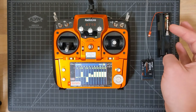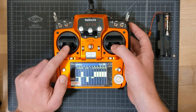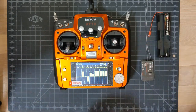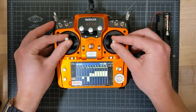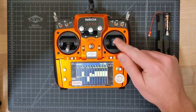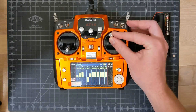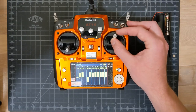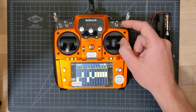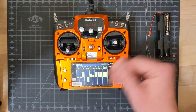Driving by controlling one motor with each hand is pretty hard to control precisely. Construction equipment like Bobcats drives like that — you control one track speed with each arm using a lever. But for this toy it'd be a little too twitchy. So I wanted to map the CatToy to just one stick: pushing forward drives it straight, turning the stick left or right makes it turn, and if it's sitting still, pushing left should make it spin left and right should spin it right. Because it's a two-wheel vehicle, it's capable of making zero-point turns.